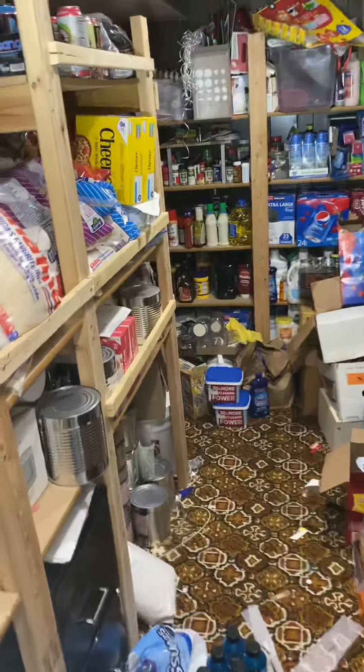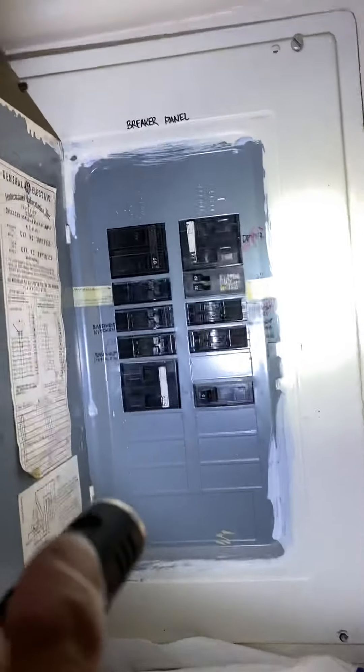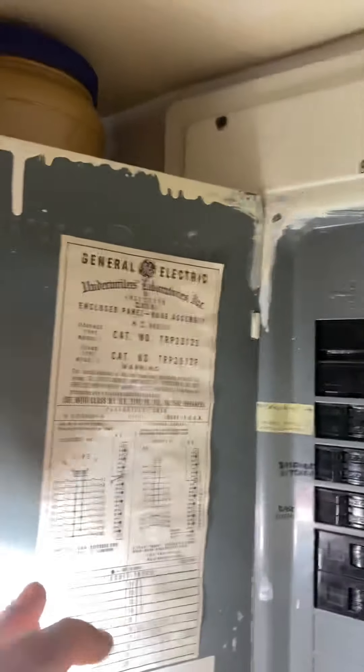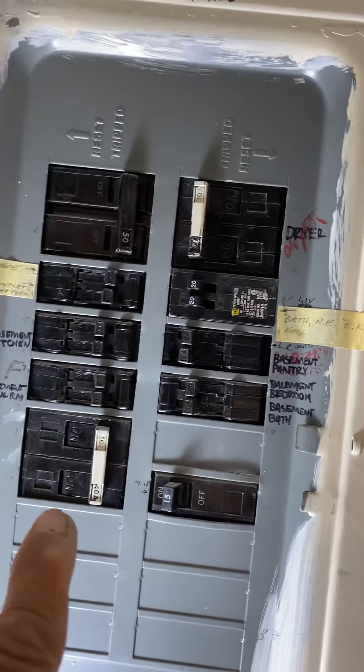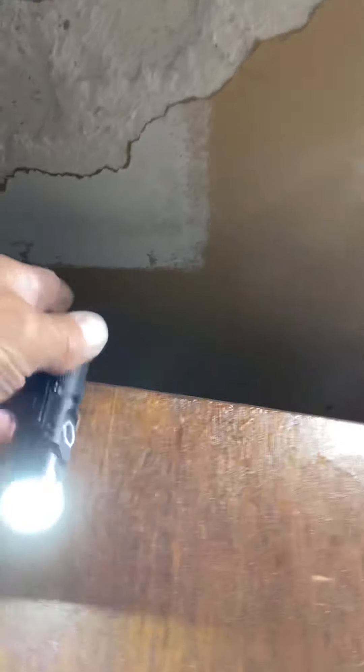Here by the stairs into the laundry room and storage room, there is a GE panel. We'll come out of here with a 20-amp two-pole GE breaker, run romex up and out, and then the electrician will run conduit all the way to the end.